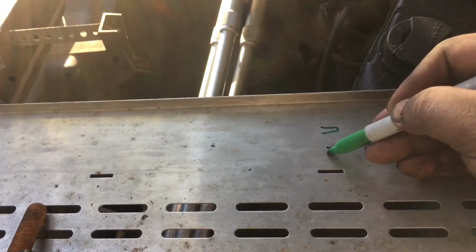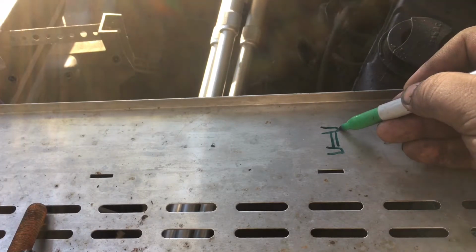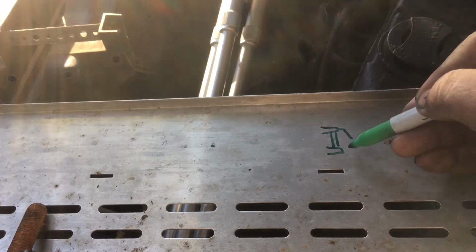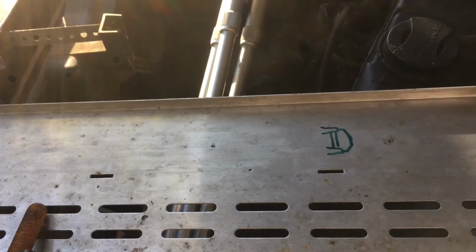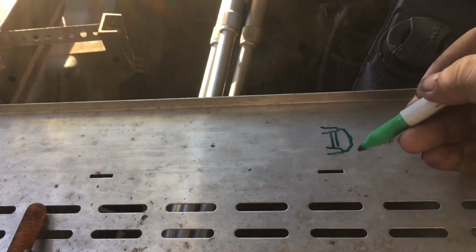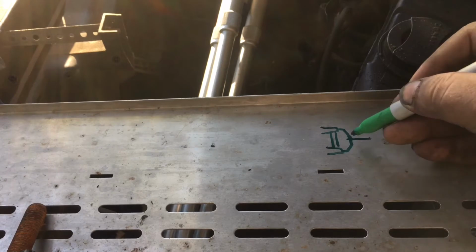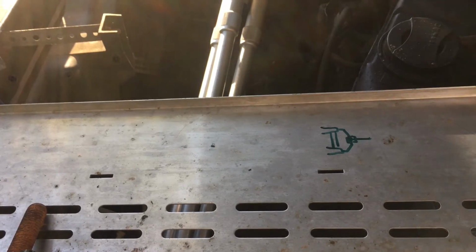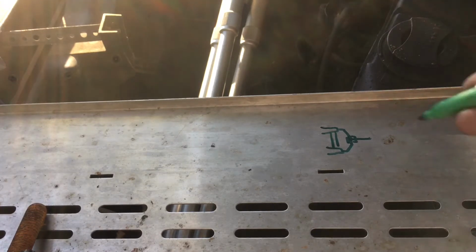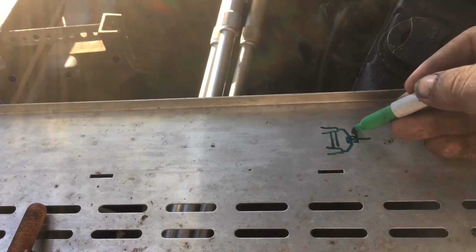This is kind of the design of the roof rack. Now what I'm gonna do is bring it out, down at an angle, into a flat, and then taper back and go back to the roof rack. And it'll be welded onto it, so it'll be pretty solid. I'll have a hole drilled through it for the bolt to come through. And I'll put one of the nuts at the base of it to act as a spacer. That way the jack properly seats up against the plate steel. Then the jack will go on.